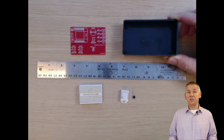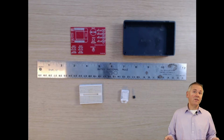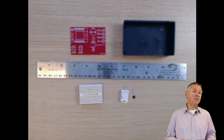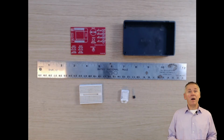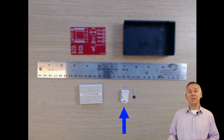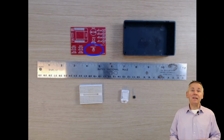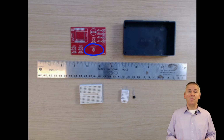The second change is to the temperature sensor that I selected. As Tasmota supports a wide variety of sensor types, I would like to provide through-hole pads that support not only the Dallas Maxim DS18S20, but also the popular DHT11 and DHT22 temperature and humidity sensors. So one or the other could be used. The idea is that we will provide 2 separate pads that have the data line linked back to the GPIO2 or D4 pin on the Wemos D1 Mini.